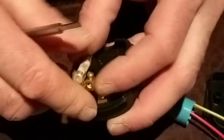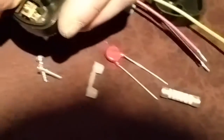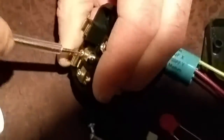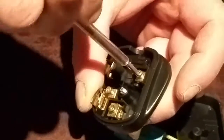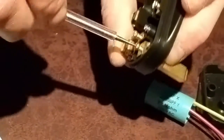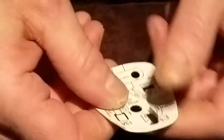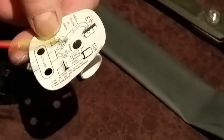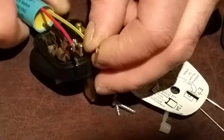We've taken that off, pulled it out, flipped out the fuse. Now we've got to loosen the terminals. This plug already has a guide on how long to cut the wires, but because this goes a bit further out, we need to judge it ourselves.